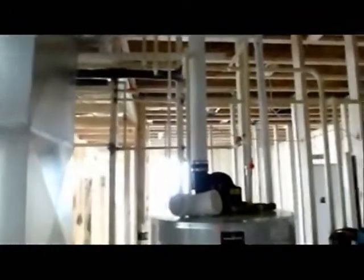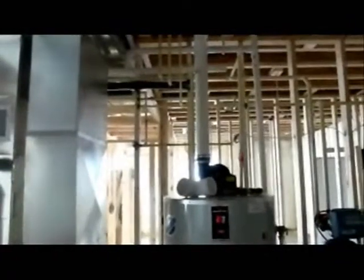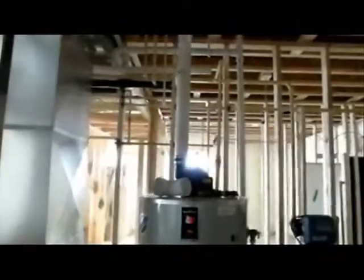We'll have a pump here at the water heater, and that will recirculate the water. When this pump runs intermittently, it will always make sure that there's hot water in there. So for convenience, the homeowner, when they turn on their bathroom faucet at the farthest point over there, they're not going to wait 30 seconds or a minute for water to come out that is hot enough to use. They'll have hot water within about two seconds.